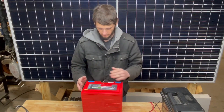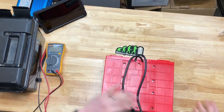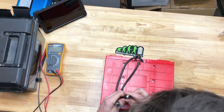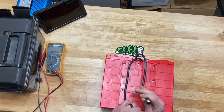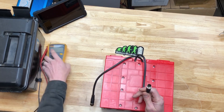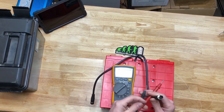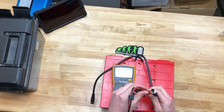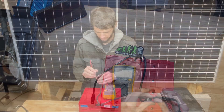There's an access panel here. The first thing I thought was this has five pins on it — it would be kind of silly, but I have to wonder if this is the sense leads for the individual cells. If it is, that would make adding a BMS quite easy. Let's measure between a couple of these pins.